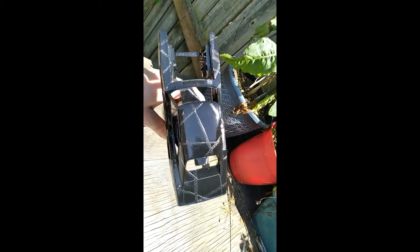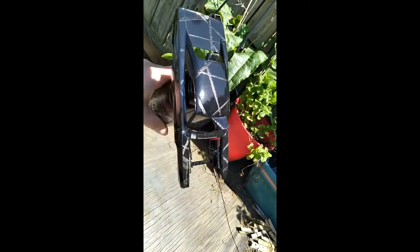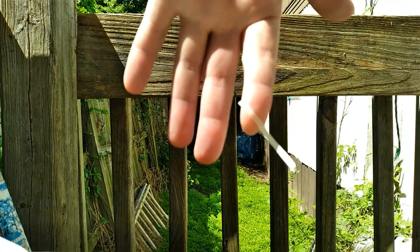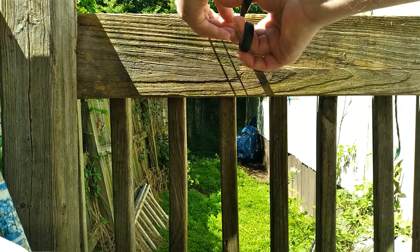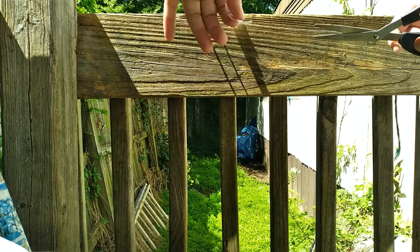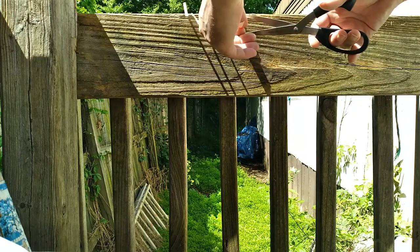I'm not sanding in between coats. So the next masking layer is going to go directly over this finished coat, and then we're going to paint over the top of that with the next layer. I would allow 24 to 72 hours of dry time, depending on your climate and environment. And the paint that you're using, all of this can vary, but for general purposes, anywhere between 24 and 72 hours, the paint should cure and be good enough to start cutting more stripes.